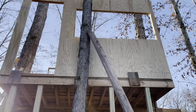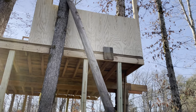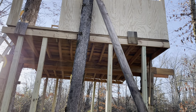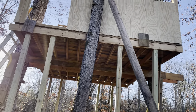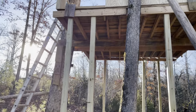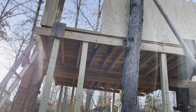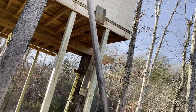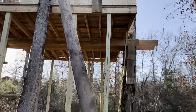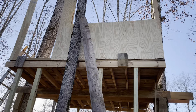The one thing I don't want to do is stress this wall here. It'll come back down because the other wall — once I get it sided — I'm going to put all the trim on and paint it before we stand it up, so it'll be finished. We'll paint it, put all the wall trim on this other wall, stand it up, screw it off, brace it down real good. Then we'll come back and lay this wall down again, paint it, and put all the trim pieces on it — so we're not hanging off a ladder doing it, because you're a good ways from the top.